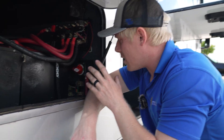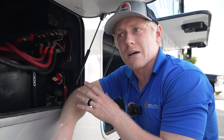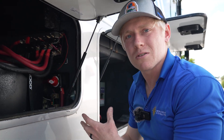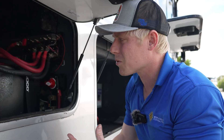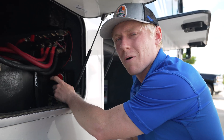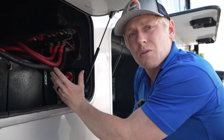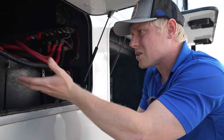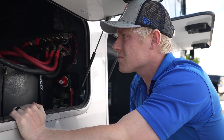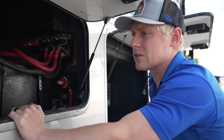We would never have designed a 12-volt system from scratch because of this issue. Dual 4/0 runs are an atrocity — that's so much work, so much cabling, it's expensive, the switches are going to get warm, and there's a lot of current flowing through them. We would just have gone with 24 volts from the beginning and wired some of these batteries in series and the rest in parallel, but we don't have that option now because the inverters are already purchased and already installed.